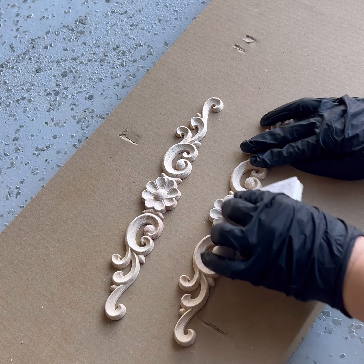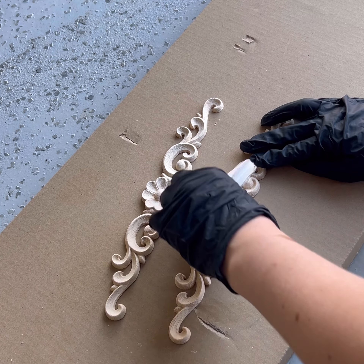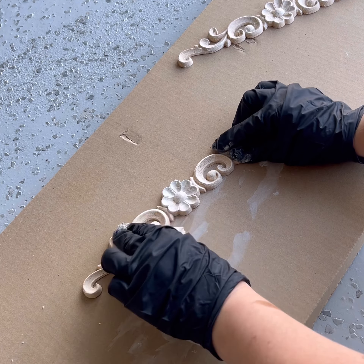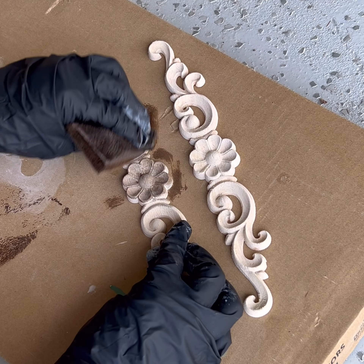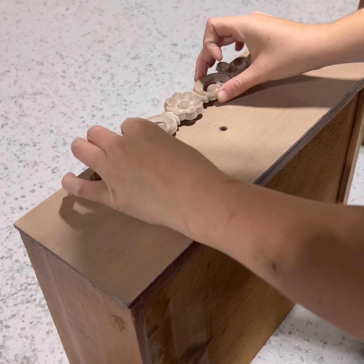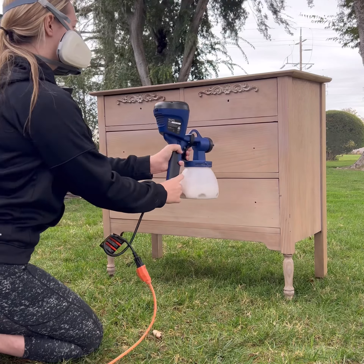One of the keyhole covers was broken, so I had to figure out how to cover those holes. I found these cool wood appliques on Amazon and figured I'd stain them to make it look like they were always supposed to be there. I did the exact same process as the dresser — first a paint wash, then the darker stain layered over top. They were pretty hard to stain because of the small crevices, so eventually off camera I just poured the stain over them and wiped it all off that way.